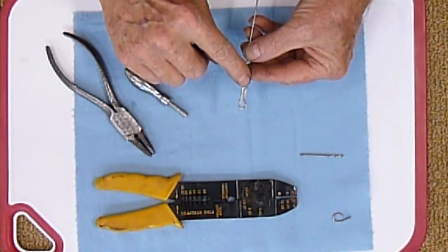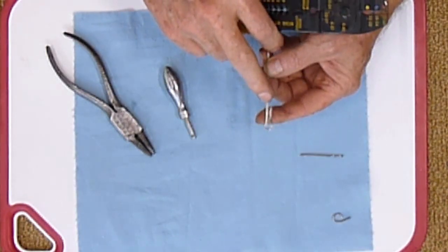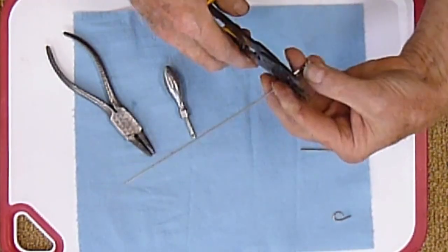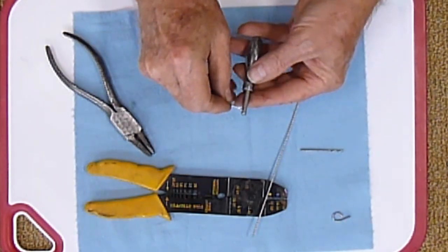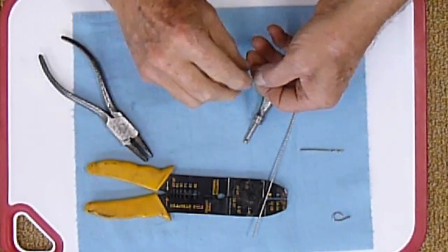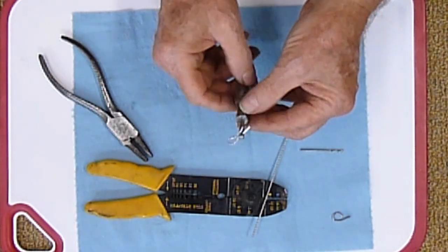Okay, so I've got this little piece here sticking out so it will jump over the outside of the major diameter. I like to cut this piece here a little bit long so it'll start in the hole before I start coming over that little snapped area. Now I'll deburr both of these ends. And there it is. I think it'd be a little bit tighter. There you go. Now it snaps right in there. All right. So let me deburr these and we'll fit this to the machine.